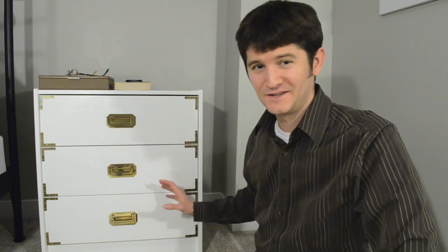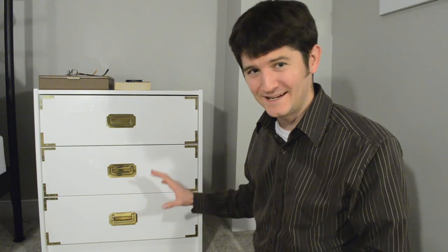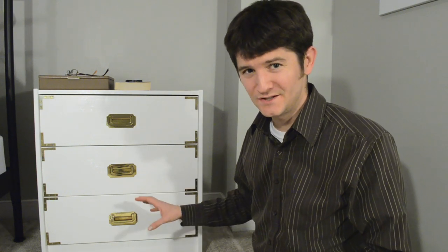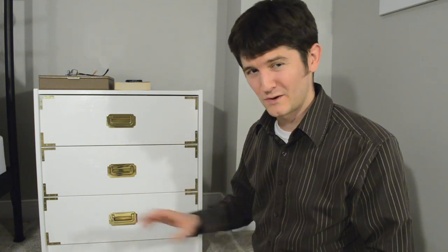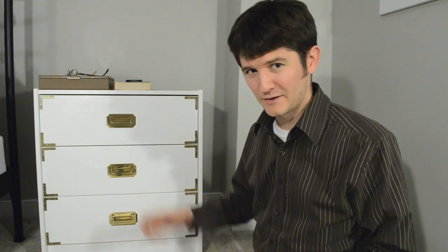One last thought: if you live in a small condo or apartment like we do, you can complete this project, but you're going to need two things. First, a space to paint — we used our kitchen and set up the shelf drawers on top of cups so we could paint around the edges and on top of the drawer heads. Second, a place to route out the drawers — we used our balcony for that, and then went back with a vacuum cleaner to clean up any sawdust left over.